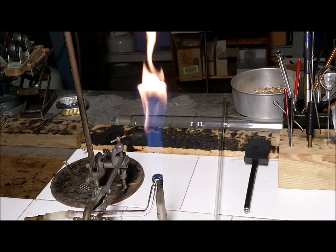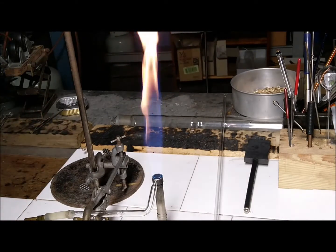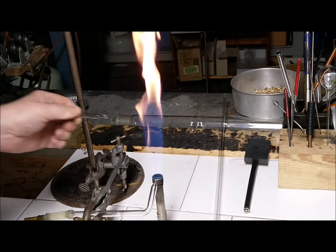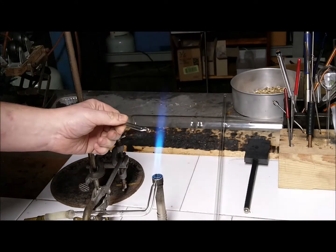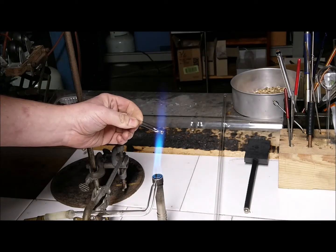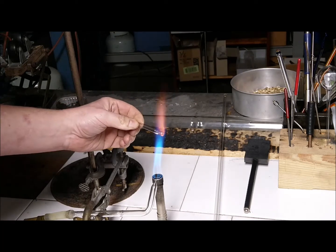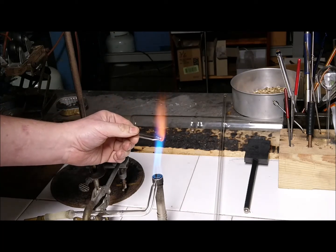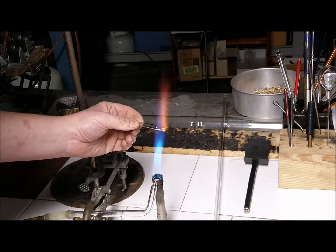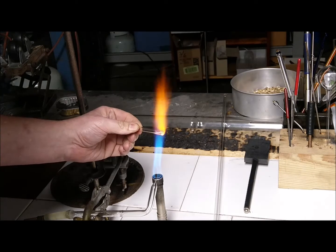The first thing we're going to learn how to do is get a small piece of glass and make a blob on the end of it. We'll use this blob later on as a bit of a tool. So just get it in the flame, maybe use some tweezers to squash it up a bit, but once it's formed a small blob or it gets out of shape you can use your tweezers to push it back to something that looks like what you want and keep control of it.